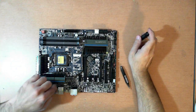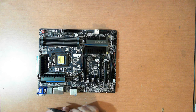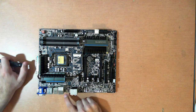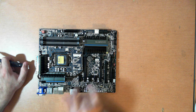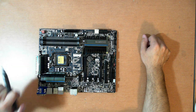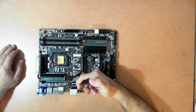Now the benefit of the VLI hub here is that the VLI hub can also take the signal and strengthen the signal, as USB has huge distance issues, right? So if you take a port from here and put it here, that might work, right? However, if you want to put ports over here, just a small change in distance from routing from the PCH to the front or the back panel will cause signaling issues. Thus, the VLI hub is actually doing something more than just multiplexing the ports. It's also helping the signal integrity.